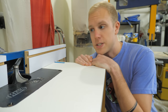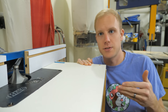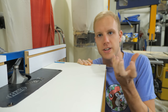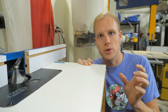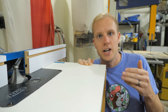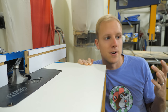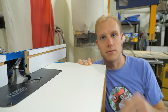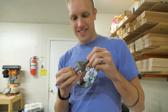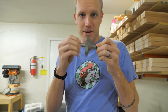It's actually pretty cool — this bit is loud, scary, heavy, and fast, but it cuts like a dream. I'm extra cautious with it because it's so large, but we haven't had any problems with kickback. It takes everything out in one chunk. I think it's because there's enough mass and inertia to cut through the wood, and it's proportional to its size. I tried trimming the corners on the bandsaw and honestly made it worse, so we're just going to take the feet straight to the router bit. We've got the fence here for safety. Curious — have you guys ever used a router bit this big? Let us know in the comments what's the biggest router bit you've ever used.